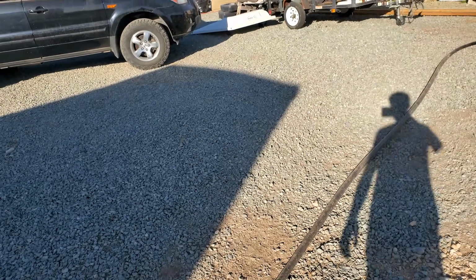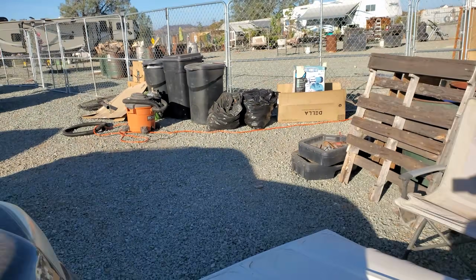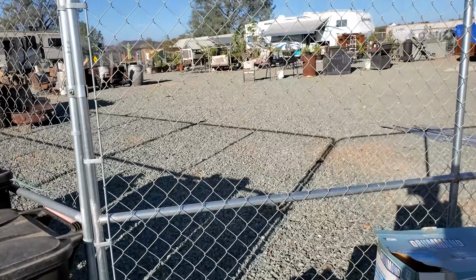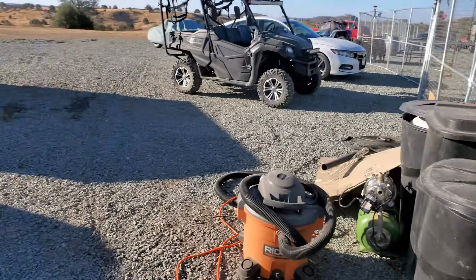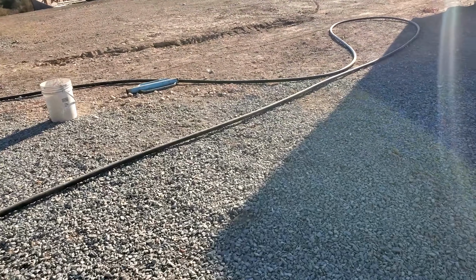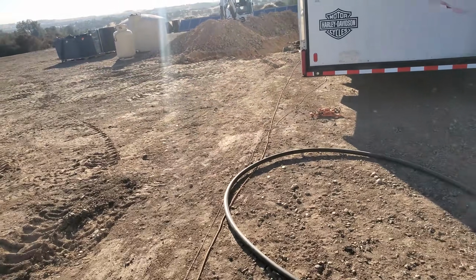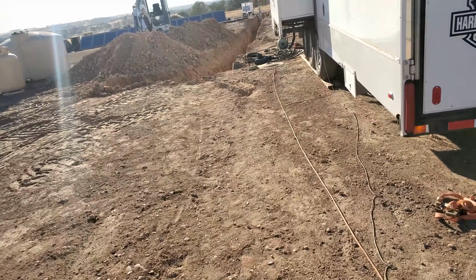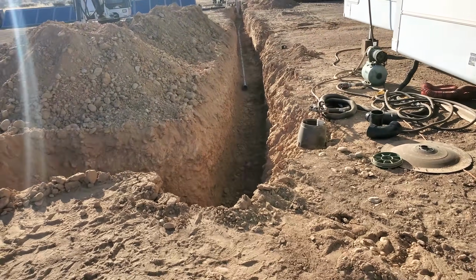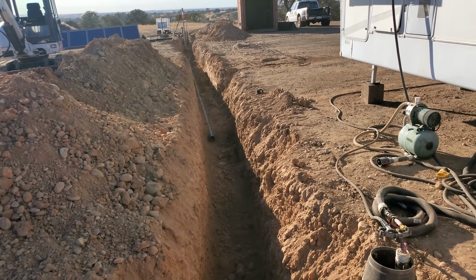I am going to put a 300-gallon tank in the ground, and that is going to be a sewage tank, and that will have a pump in it, because from this area here in the courtyard, we can't make grade all the way to the septic system. Even if I ran 1/8 per foot, which is the absolute bare minimum for plumbing, there would be no way possible to make the grade because of the elevation difference. So essentially I'm going to pump or let it flow, gravity, 1/4 inch per foot drain lines into a 300-gallon tank, and then from there I will pump down this pipe and it'll go into septic tank number 1.